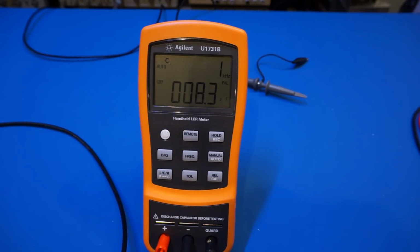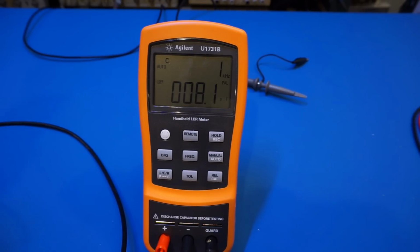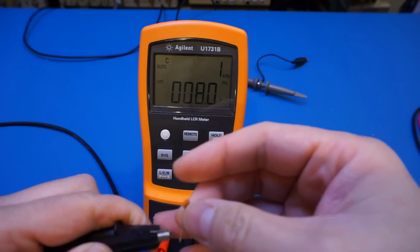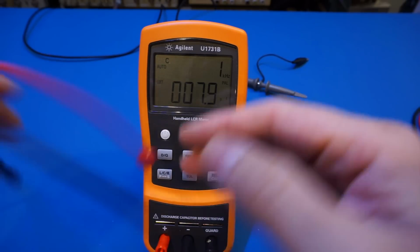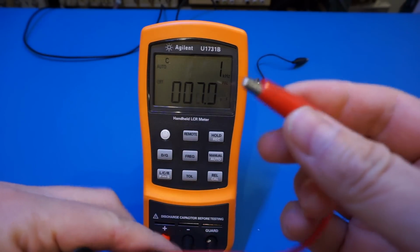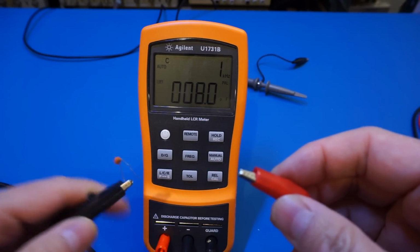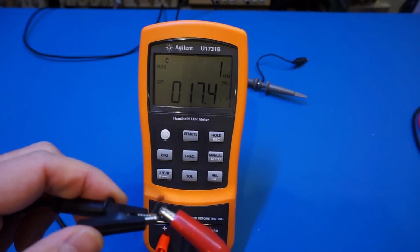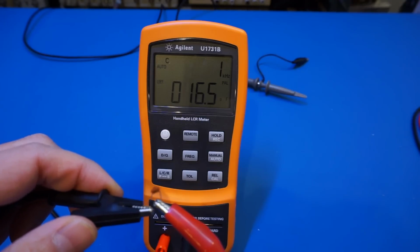So now we can use the setup to measure our 10 picofarad capacitor as before. And again, I'm using the negative, which is this alligator clip, to clip it to the one leg of the capacitor. And the other side, basically, I'm only going to use this center pin, which is the red terminal coming from this positive input. And the guarding terminal, I just leave it floating. So now you can see that we get a much more accurate capacitance reading.